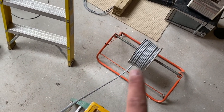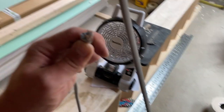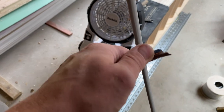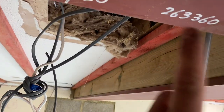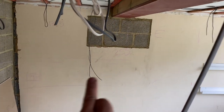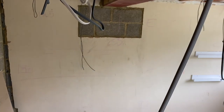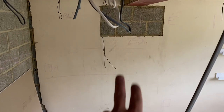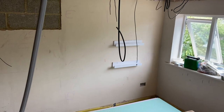These drums are a hell of a lot heavier than 2.5. Four-mil stranded — I think it's seven cores and a 1.5 earth, or two five. I'm just pulling this leg through here, then it'll run along and drop down to the first socket point. For the extractor hood and so on, I'm going to put a couple of switches in the cupboard to keep a minimum look — just one USB double socket here and one on the other side.